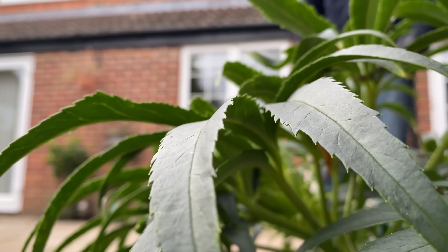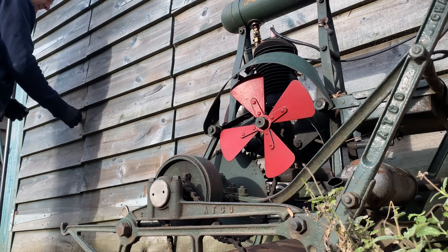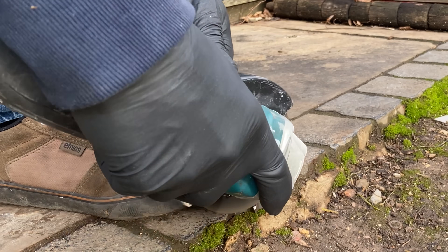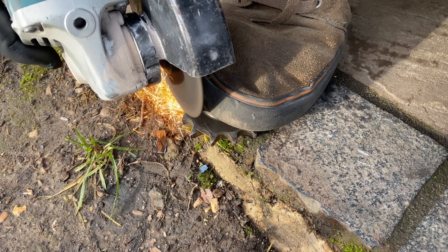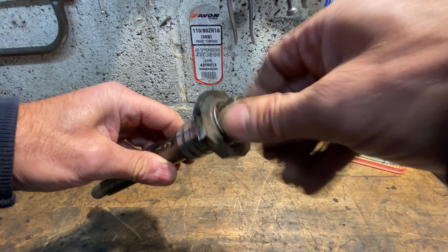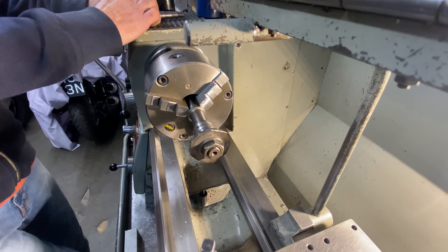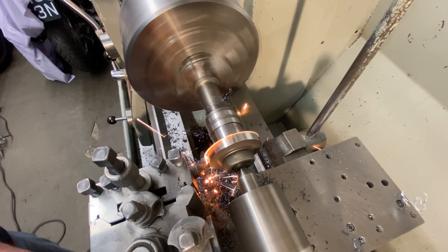The next thing I need to do is cut off the teeth of an old front sprocket. I go up to my shed to use my angle grinder, and I notice the robin having a bath — he loves it in the bird bath. I need to turn the sprocket into a round diameter on my lathe, so if I cut off the teeth first on my angle grinder it saves a lot of machining, because this is case-hardened steel and it's really tough to machine. With all the teeth removed, I go back to the garage and mount it onto a spare gearbox shaft, then mount the shaft in a three-jaw chuck on my lathe. I put the centre in to support it and start machining using a brazed carbide tool — the swarf comes off so hot it glows red hot.